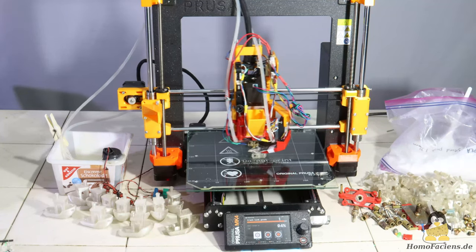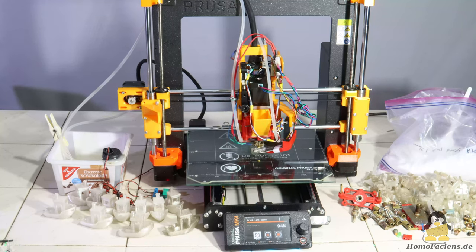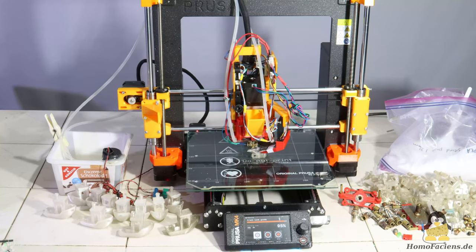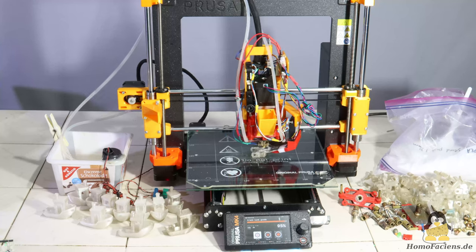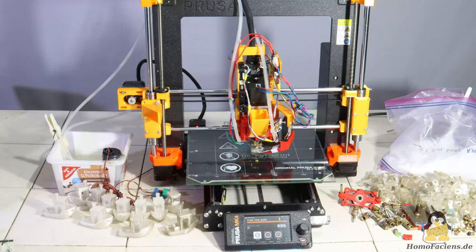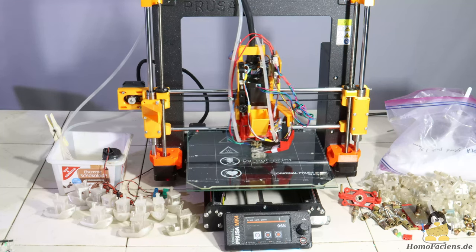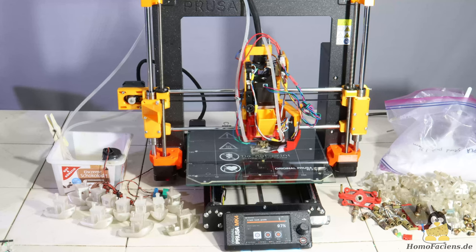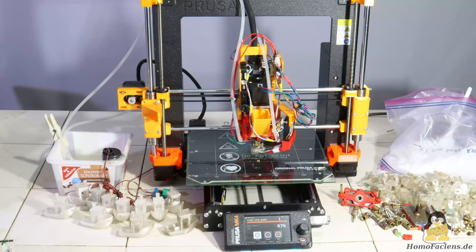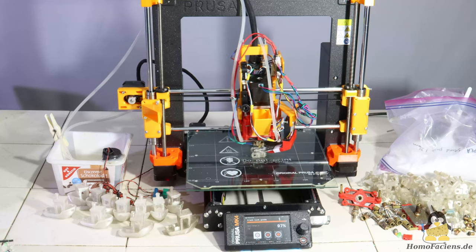Once again I carried out lots of experiments to further improve my granules extruder. Again I have modified the mechanics of the Prusa Mark IV in that I have now attached the cone of the material supply to the front. The reason for this is that the fine powder that I currently use as raw material does not flow as nicely as the granules from shredded plastic that I previously used.